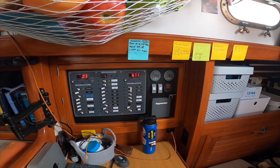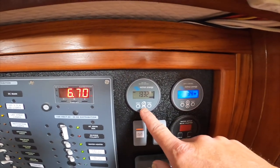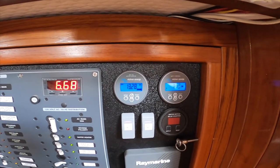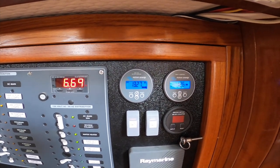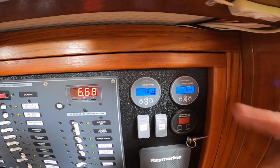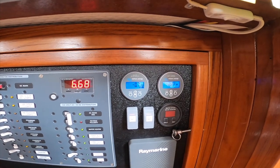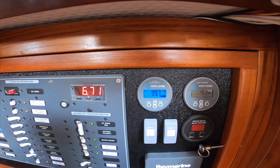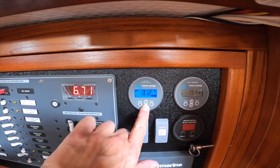The whole concept of this is we're just cooking with electricity — we don't have gas on the boat anymore. Right now we've got 134 watts coming in, we're at 13.29 volts. We were pretty much 100% when we started. We just flipped on the water heater, which is pulling around 1500 watts. We've basically drained 0.6 amp hours out of the battery bank just by flicking that on — not bad. We're getting 126 watts of solar on a cloudy day, sun nearly dead overhead, making about half of what we normally would.